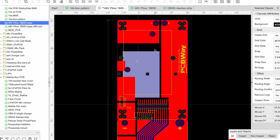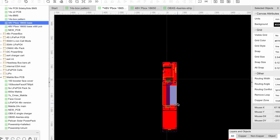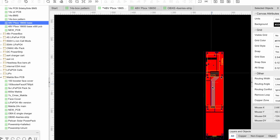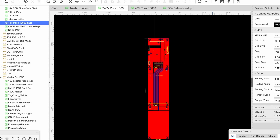What comes out of the BMS then goes to the negative output pad. It's a very simple design - all it does is put two of those boards in series and run them through this BMS. All of these pads are trace fuses for the balance leads on these boards, and then half the pins go to the first board and half to the second, because they're in series. That's the way it works.